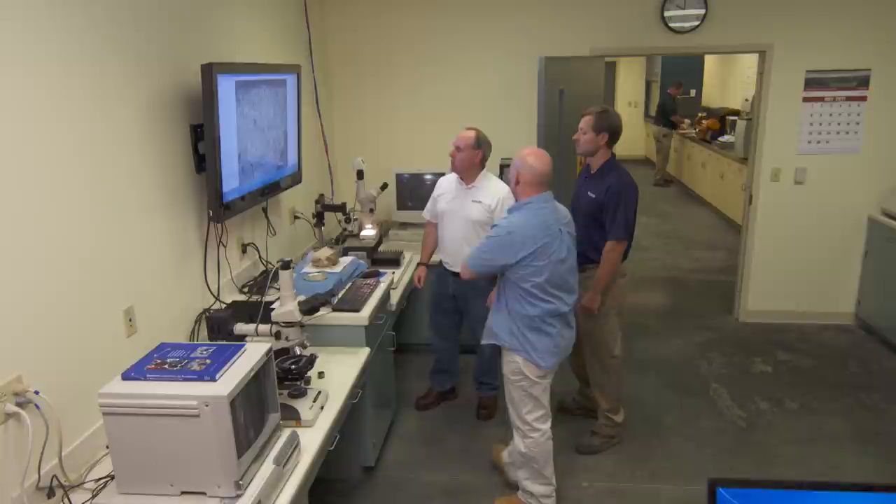So when we get a sample like this, especially from an older building, we want to look at the composition of the mortar itself. We look at the sample at 20x magnification, and you can see the lime and also the different natural sand crystals. The natural stuff is just all this discoloration right there — that's just different particles and sand. And the white particles you can see is the lime, which is what we wanted to verify.